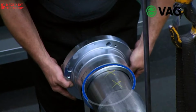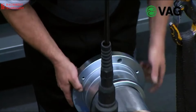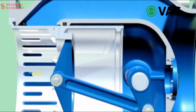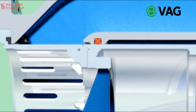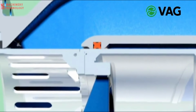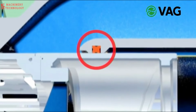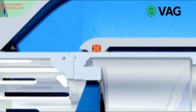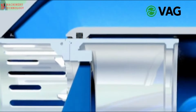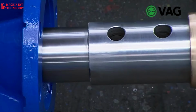The next step involves installing the piston drive shaft, yet another component crafted from a special type of stainless steel. This critical shaft transmits the force from the motor, ultimately leading to the automatic closing of the piston ring. The assembly process for this shaft demands the utmost precision and often requires the assistance of a crane for proper positioning. Once secured, stainless steel bolts and washers are used to finalize the installation.